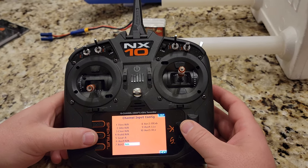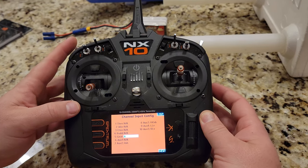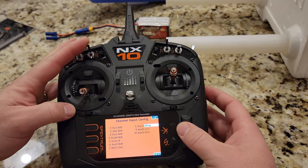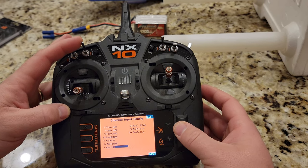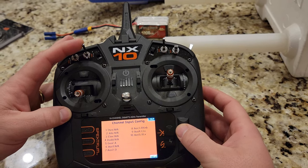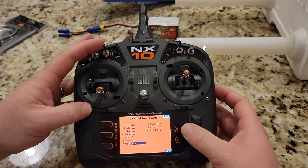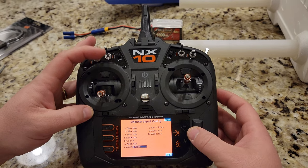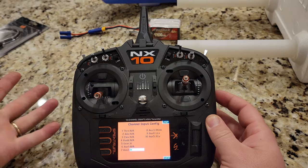So then what are we gonna do for flight mode? We don't have to assign that to flight mode. But what we'll do is we'll use aux 2 for flight mode. So you can either do D or flight mode. Okay, so remember D is commanding. You can scroll all the way over and then flight mode, or you can just actuate D. So now aux 2 will be how we control things.